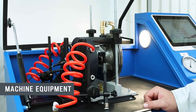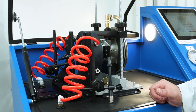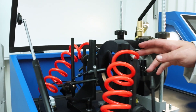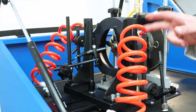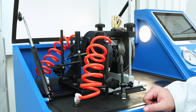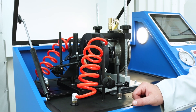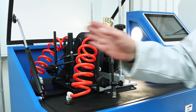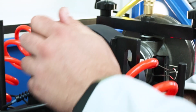Now installed is a universal acceleration adapter with a large turbine wheel. One tube plugs into the top socket, the opposite tube plugs into the bottom socket. If the turbine has a reverse rotation, these tubes are reversed — this one goes into the lower socket and the far tube goes into the top socket. This tooling is designed for mass production when the turbines are large and of the same type. It is more convenient to work with — you don't have to adjust the nozzle for a new turbine every time; you push in, you push out. This tooling has an outreach adjustment and also a height adjustment.